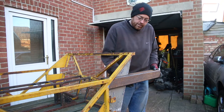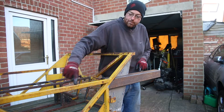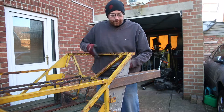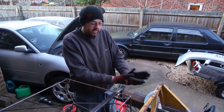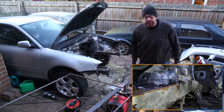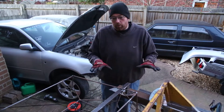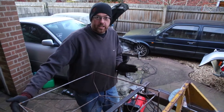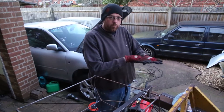It's time to start welding things back into the frame. We've got these legs that we made and cut and they fit in quite nicely. We're going to clamp the one from this side down temporarily so we can weld and get this exactly parallel, then cut the inside to flatten it across because we need a bit more room. After locating this leg, we've realised it's an awful lot of work kinking these legs in, and on the A3 there's a lip on the gearbox side which we wouldn't have with two box section legs. So we're going to build a pad that comes out, mount both legs dead straight, fit the engine where it wants to go, and extend this leg inwards to provide support to the engine mount while still letting the gearbox sit underneath the chassis leg.